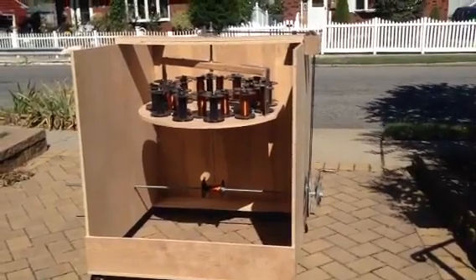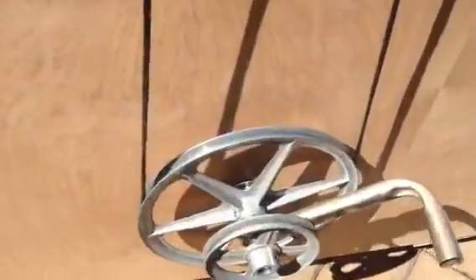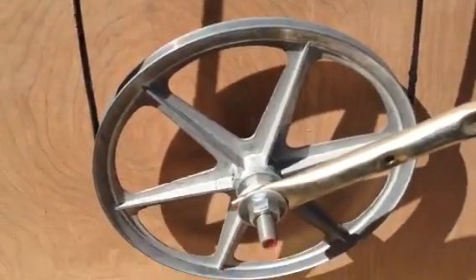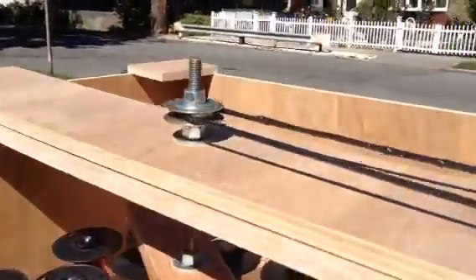Hi, this is Harry Maldonado and this is my Litz machine. The machine is completed now. I needed to change my pulley — this was the original pulley I had on here, and you can see the new one is much larger. That's to change the gear ratio so that the machine would spin a lot faster to twist the wire even more.